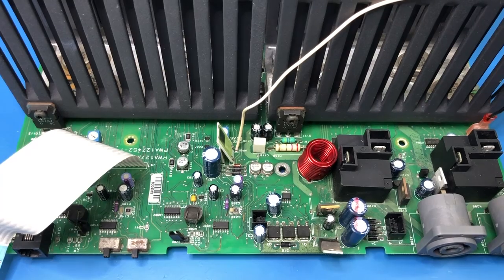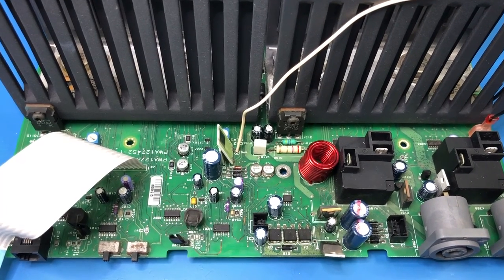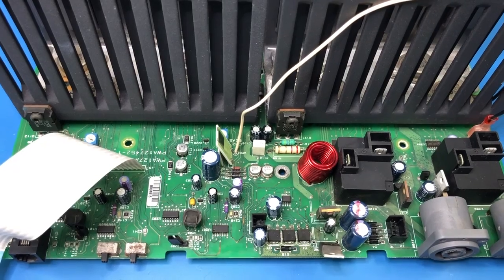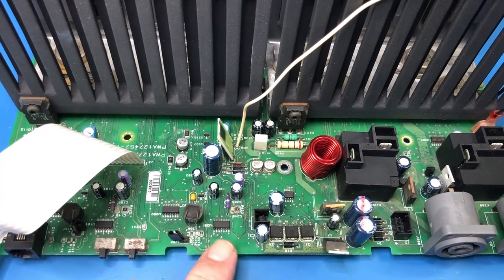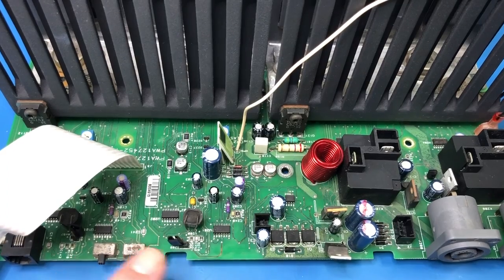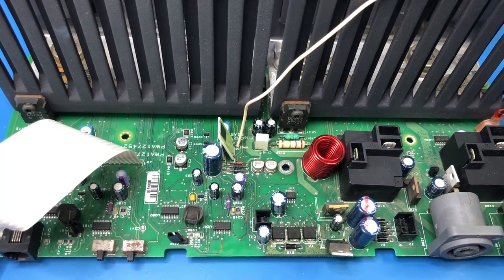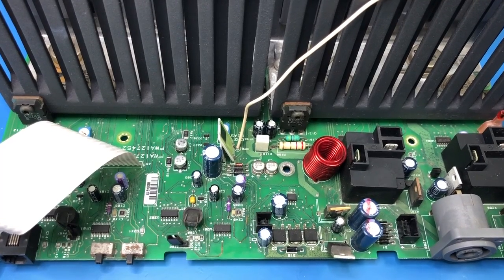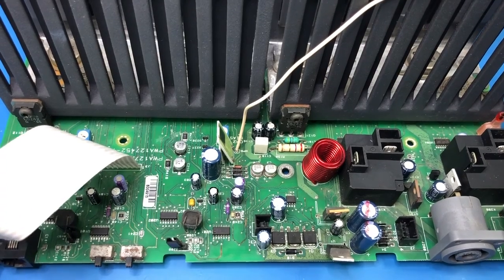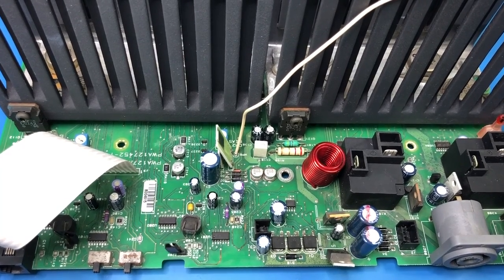This was just meant to be a technical exercise. And it's just got to the point now where it's clear that this thing is seriously ill. It does appear that it has had the proverbial blown out of it. Even if I were to repair these tracks, these op amps are probably dead as well. Probably numerous other things that are dead as well. The fact that I'm still not 100% sure which is the correct schematic, because it's really hard to work that out from the service manual, and also that the scans in the service manual are really poor as well. So I'm not convinced that I actually have a proper technical reference as to what this is supposed to be anyway. So it really is at the point now where I think it would be foolish to continue.